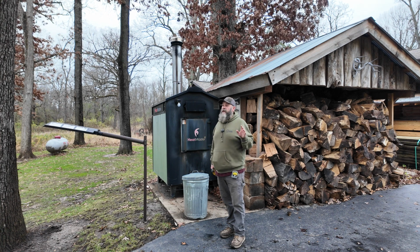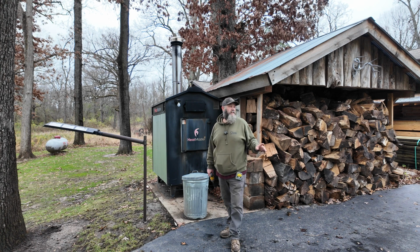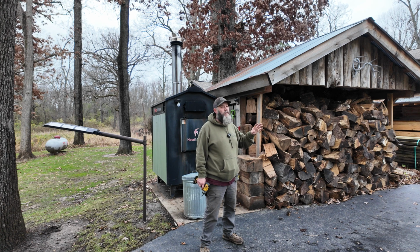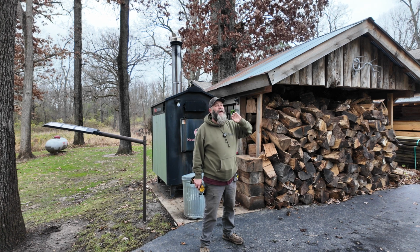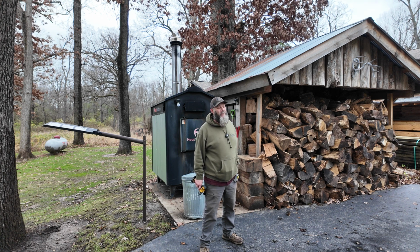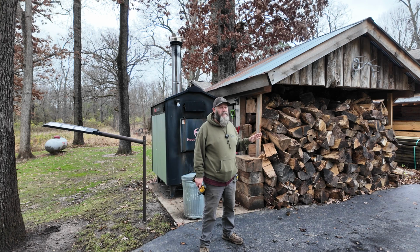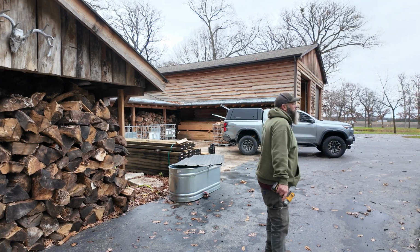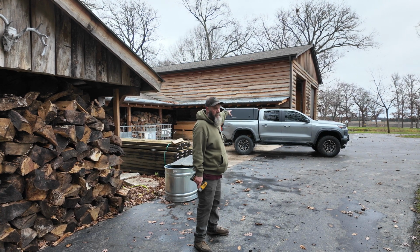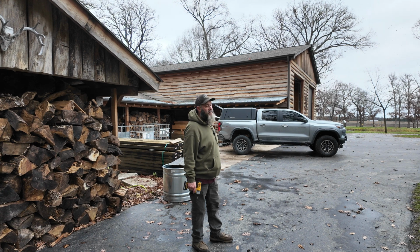For me, we heat here with 2 forced air furnaces in the house. I've got radiant heat in the garage. In my basement, we don't run it because when you do, this is a 2x6 framed house. It's got closed cell spray foam insulation, ICF concrete forms in the basement. You cannot run that floor heat low enough to keep the house from being 90 degrees. Here in my shop, we have 100% radiant heat. That's the only thing that we use LP for. That's the only source of heat. And we do the domestic hot water in there.